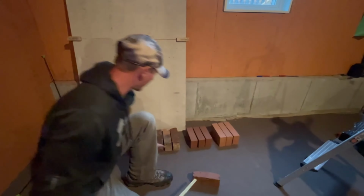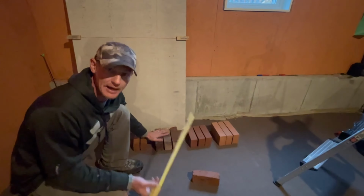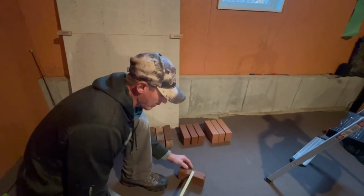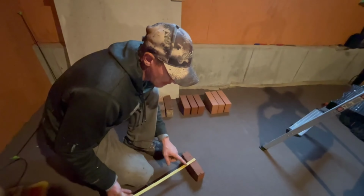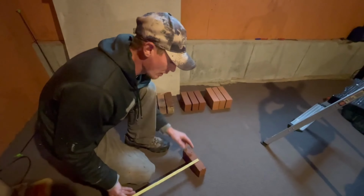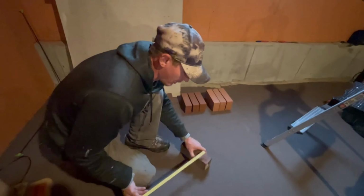And let me just say something. The brick ruler is not for this way on the brick. It's only for making heights. So the brickwork works out like this on the brick for making heights. So I can look at this brick and know that this brick is really skinny, and it's probably only going to work out on ones here with kind of fat joints. That's the best I can get with that one. I don't really want to go to 2s with that because then the joint gets fat. So it's probably only going to work out on ones, whereas these bricks are quite a bit bigger.